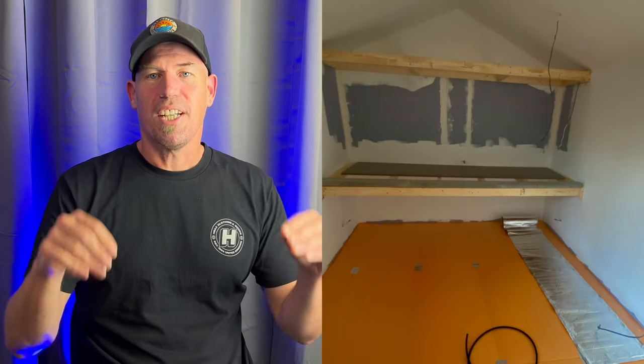The only professional tradesman I brought in was an electrician, who fitted the consumer box, made sure everything was safe, and checked all my wiring was done correctly. I went with various LED lights switchable from my iPhone app. The electrician also ran the main power cable from the house into a separate feed on my consumer board, and put an extra power outlet on the outside of the shed so I could power things in the garden.